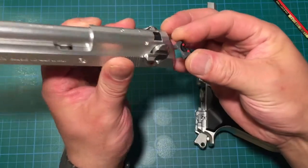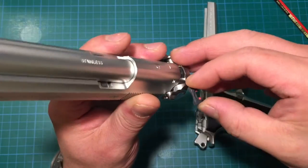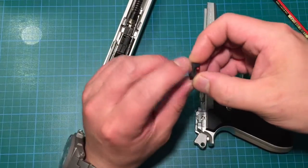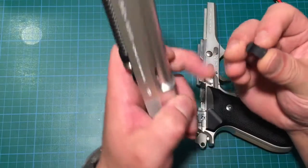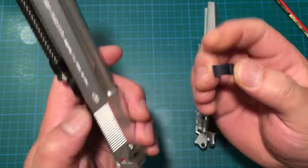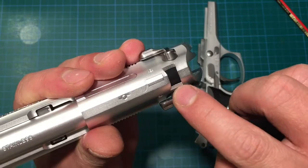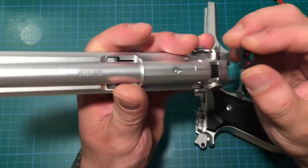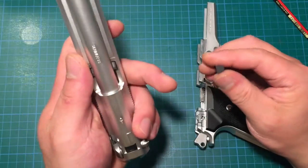So when everything's disassembled, we're going to put some epoxy mix on these scored parts with the markings. We're going to slide it in, and when the glue sets, it's going to bite into the score marks that we make and the indentations and hold everything in place. When you do this, you want to make sure there is no glue on the crevice there, the curvature on both sides. You literally just want the epoxy on either side of the rear sight and the slide, and make sure that it is aligned correctly. It needs to be aligned perfectly, otherwise your sights are going to be off.